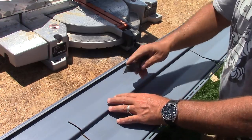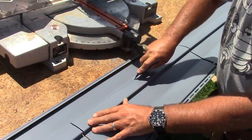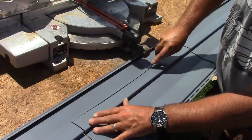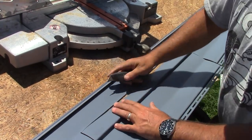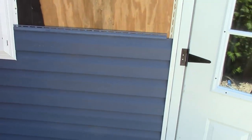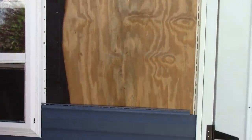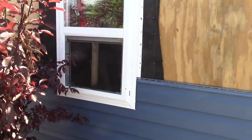We're going to finish the cut on the back side with just a knife. Vinyl is very slippery, so take your time. I recommend scoring it in two passes — the first one light, the second pushing a little bit harder so you have a track to follow. Let's check the fit. It took a little maneuvering but the piece fits right in there really well. Now we can work up the sides of the window, double-checking for level so both sides meet evenly at the top.